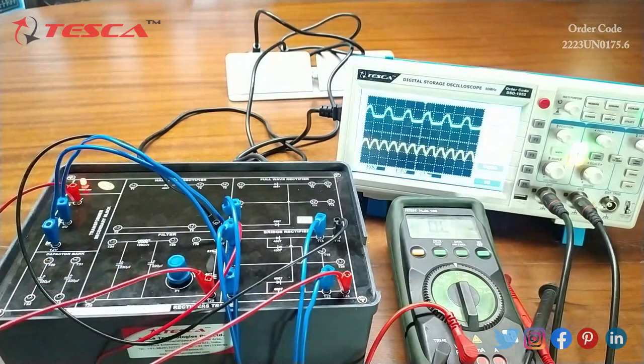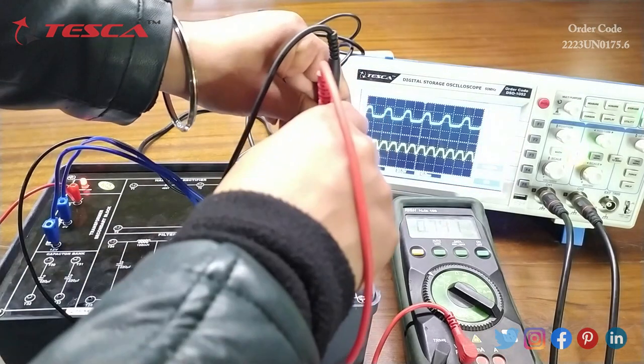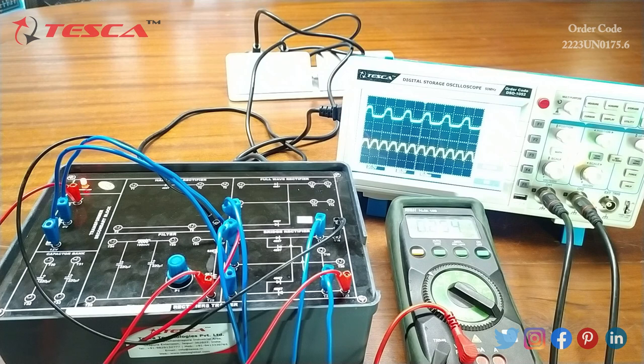Now we get the proper waveform. With the help of the multimeter, I will measure the output voltage. The output voltage is approximately 0.7 to 0.8. We can see that diodes D1 and D4 conduct in the positive half cycle of the AC, while D2 and D3 are reverse biased and off. In the next half cycle, D1 and D4 become reverse biased but D2 and D3 are forward biased and give output. So the output consists of positive half cycles for both positive and negative half cycles of the input AC — that is full-wave rectification.